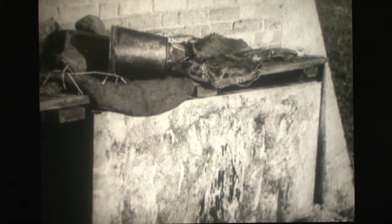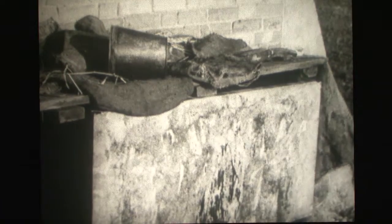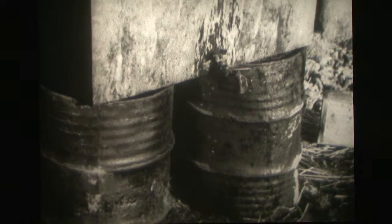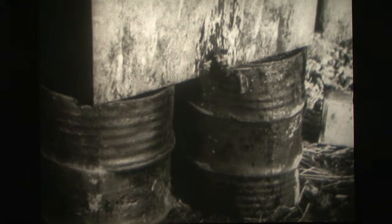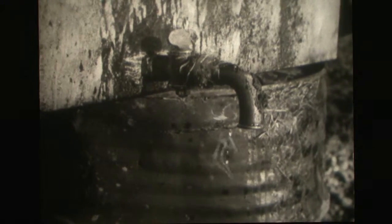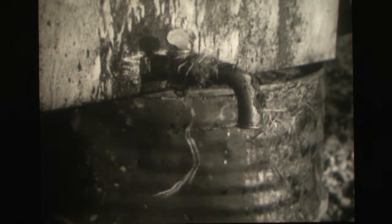That top is wide open to collect any muck that's floating around, not to mention the rain. And all that dirt round the tap. It won't do, you know. All the efforts taken by the oil companies to ensure that the fuel is delivered clean is not a ha'porth of good if it's going to be stored in a rough old tank like this.